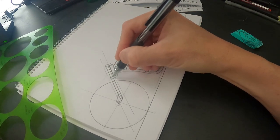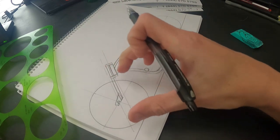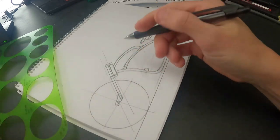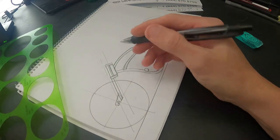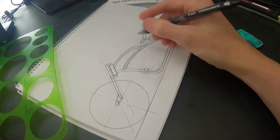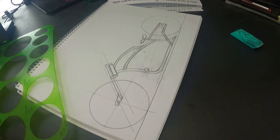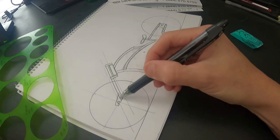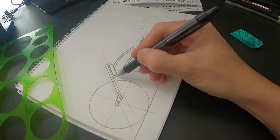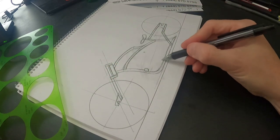This gives you an idea of what you're looking at — where do you want to run that extended dropout, do you want that wheel out? You need to take all these things into consideration. When you do a mock-up before building anything, now you know — if you used a stock fork and your tire is hitting and you're not level, you've got to move the frame down. Build some extended drops, move that wheel out, and that gets rid of the problem.